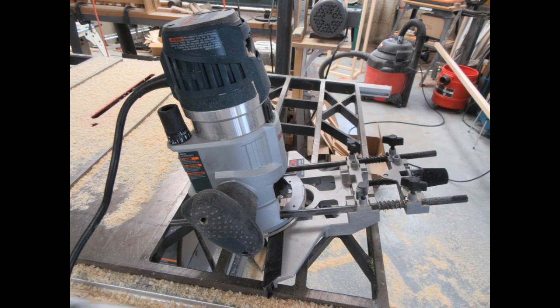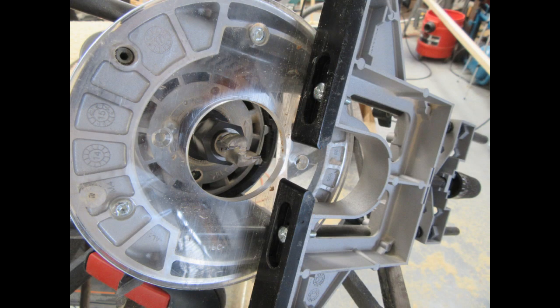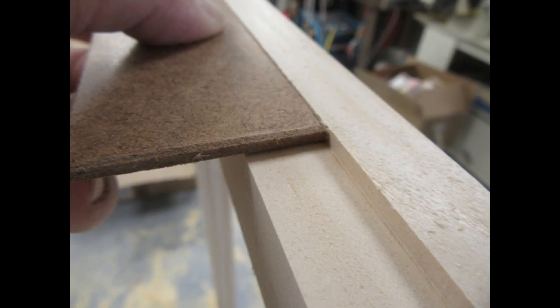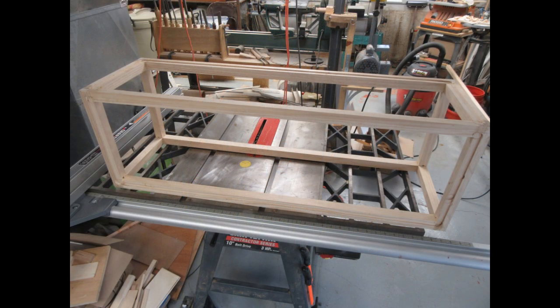Here's my router with the fence on it — it's a large router, a little bit unwieldy, but it does work well for this. I use a three-quarter inch bit in it, which is wide enough to do the job. After routing one side of one piece, I take a scrap of eighth-inch masonite or tempered hardboard and sit it in there to make sure I got the depth correct. The idea is to have the masonite ever so slightly recessed — just the thickness of a couple sheets of paper — below the pine frame so I can sand that down later to match the height of the masonite side panels. For routing the ends of the case, I just set it on the floor and clamp it to the end of the table saw's wing. Here's the frame with all sides routed for the inlay.